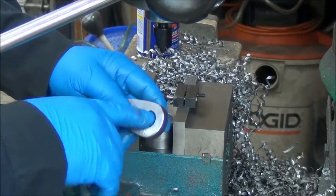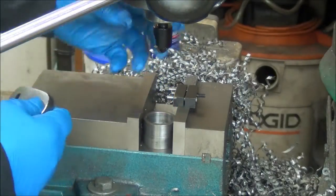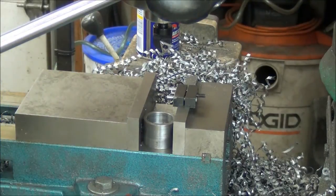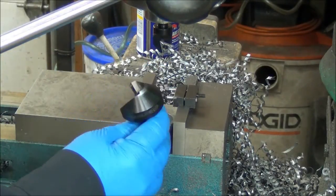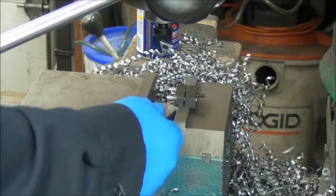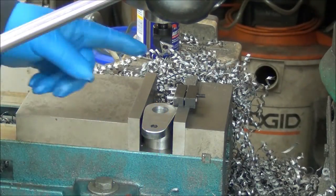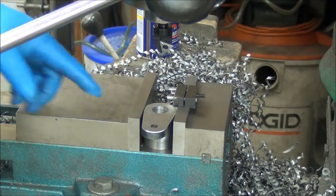I've got a box of about 80 of these left to do, and I still have to chamfer one side for the welding. I've got everything set up here — I'm using a set of three countersinks in three different sizes that I got through Shars. This is the small one, and it was just big enough. I'm still using basically the same setup, zeroed over the same spot. This takes almost as long as the drilling — I run it down in there and spray oil.